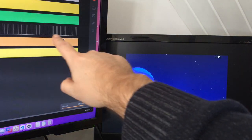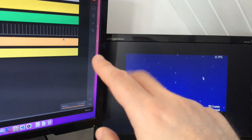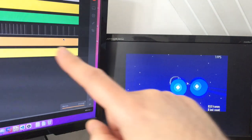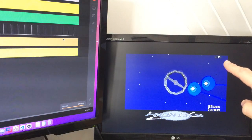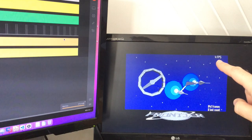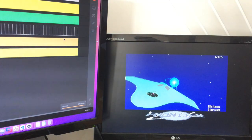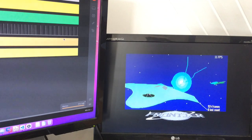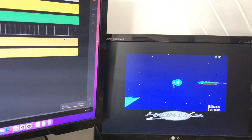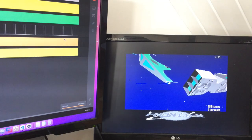And you can see the frames getting, the pulse is getting tighter and slower down. It's dropping there as it goes down to 6 frames per second. And 4, 3, it drops again, and then bang, up to high when we go to 16 frames per second. You see, it works. It is quite effective. And I can put a multimeter on that, and it ties up quite well, the hertz count. In fact, why don't we do that now while it's running?